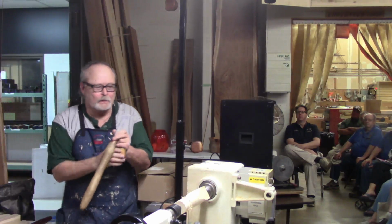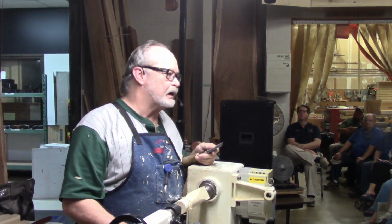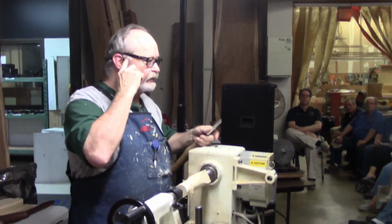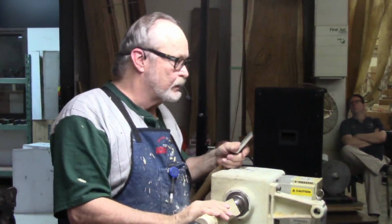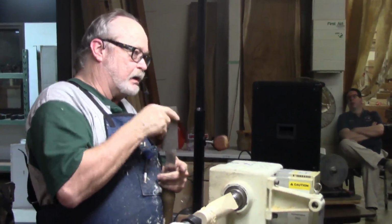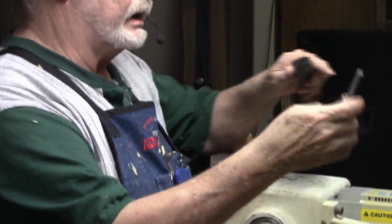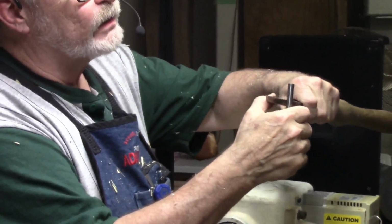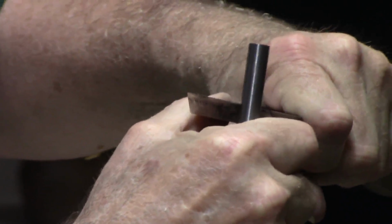Okay. You have to start at the grinder. You always start at the grinder. The cabinet maker has a scraper blade. They have to start with it filed and stoned to produce sharp corners, and then they burnish the burr. Now, we erase the burr with a hone off the grinder, and here's what is different. This is carbide. I'm going to tip it only 5 degrees towards the top. But how hard I push down is based on what I want to do with it.